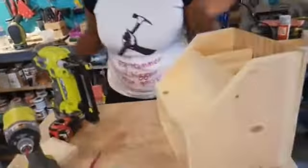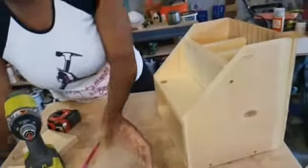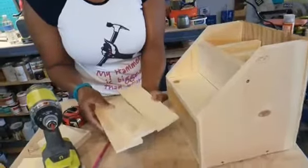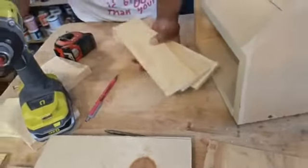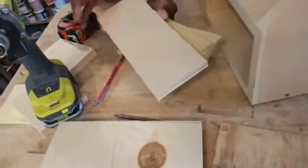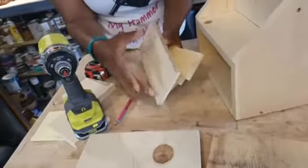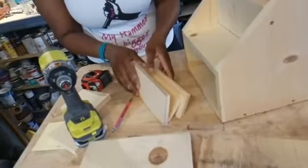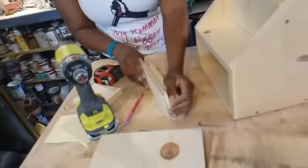And the way you make the drawer is similar. Well, it's basically just making a big old box. So we're using craft boards that you can find at your local hardware store. These are 1x3 craft boards for the sides. And then for the front, we used a larger piece of ply that is cut to about 4 inches wide, 4 inches tall. Wide is 9 inches. Okay. So the exact dimensions for everything will be listed on the blog, and the post will be up shortly. And it will also be listed on Hometalk.